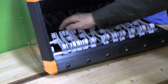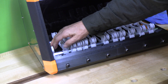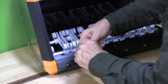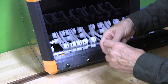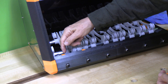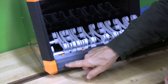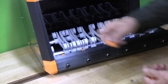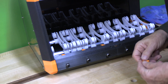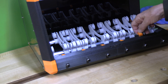Everything is very well put together — the dimensions are good, everything fits. We're going to put six sets like this, one for each reel, and set the whole thing into the container. Each reel rides on four bearings for ultra-low friction. We'll place these guides to allow the filament to come through and out through the openings, and we'll put PTFE tubing in here — two millimeter inside diameter — to guide the filament, which is 1.75 millimeters.